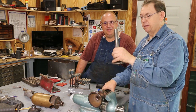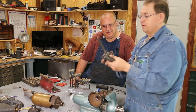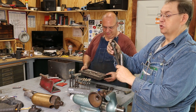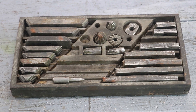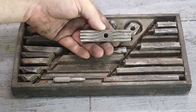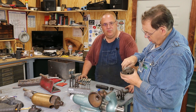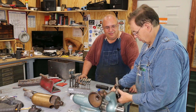This tool has a hollow stem. The hollow stem has a turning rig and it goes up to a smaller diameter extension with the cutting tool on the top. It came with a whole tray of different cutting tools. These have 45-degree angles on them for a valve seat, and there are also flat ones for a flat valve seat. This tool was actually a gift to me from Dale Derry — he had picked it up somewhere, and I know some of you guys watch Dale Derry's YouTube channel. I had never tried to use it before, but when Kevin brought this whistle in, I said I got a tool that dresses valve seats. Kevin got it out, figured it out, and we're going to dress a valve seat.